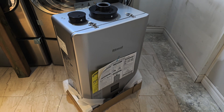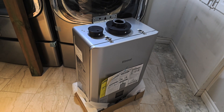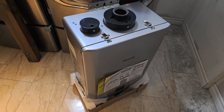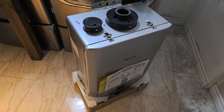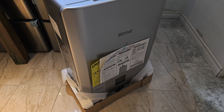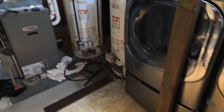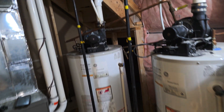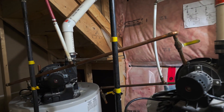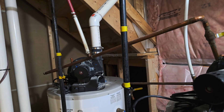My tankless is approximately 200,000 BTU, so 200 plus 250 brings you to about 450,000 BTU already. Therefore it's very important that your gas line is properly sized and please call your gas distributor to verify the size of your gas meter, so you don't run out of gas in the process. And again — water flow is very important, as is venting, and a good installation.